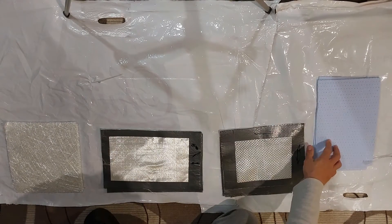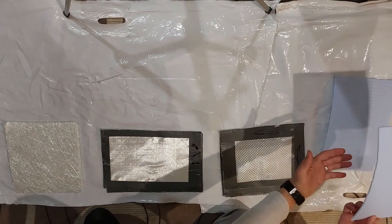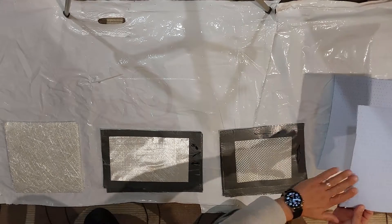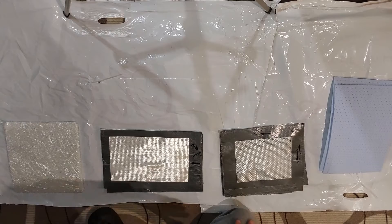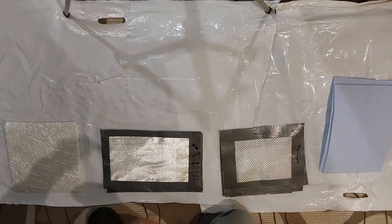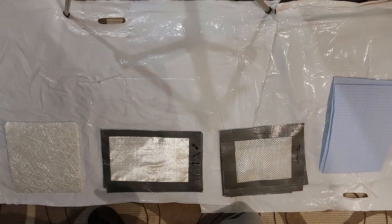The last material is the core mat. It should always be covered by chopped strand mat — you need a layer of chopped strand mat, then the core mat, and again chopped strand mat on top. But we're going to proceed the test as follows.